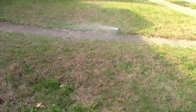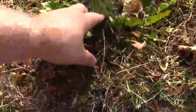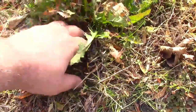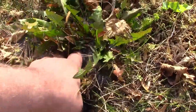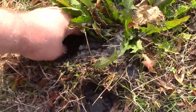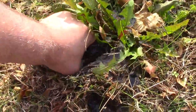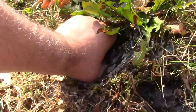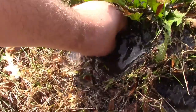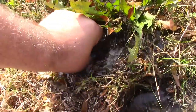The next zone has come on. We have two heads and a third that's not working, so now we have to dig around and find it. Looks like it's been overgrown. Here it is. Sometimes you can force it up with a flat blade screwdriver, but I'm going to have to come back to this one. There's been some construction in the area and they've been on the curb, so they may very well have damaged this one.